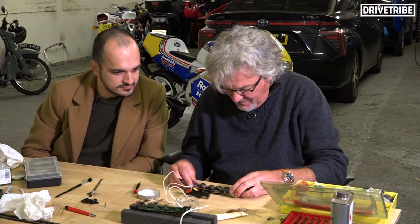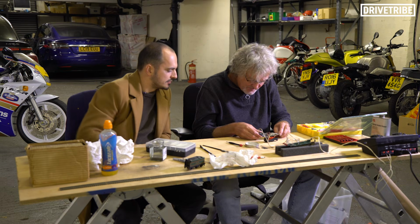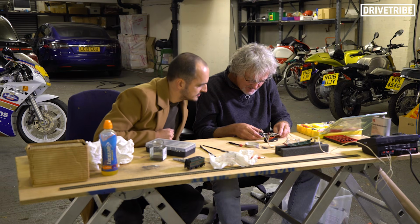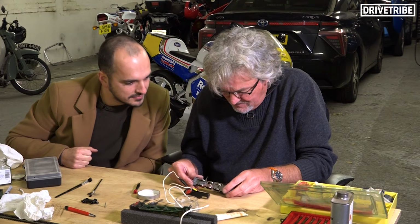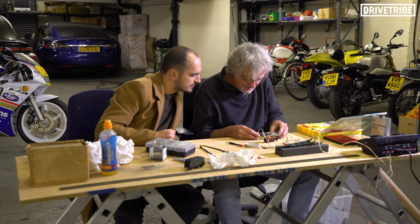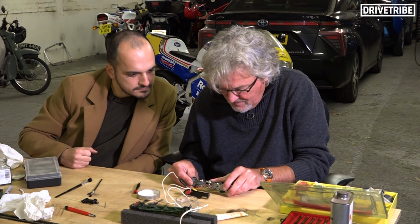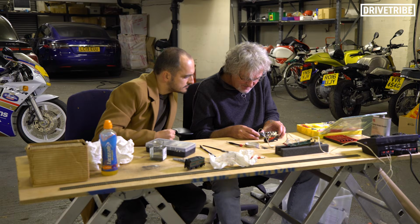The problem we now have is that the chassis is a little bit stiff. Yeah, it was very stiff. The rearmost one was the stiffest. You're absolutely right, because there's a little bit of play between the coupling rods, so I can move that front axle independently by a few degrees, and I can feel that that's pretty free. The middle driven one is a little bit sticky. That one is very sticky.